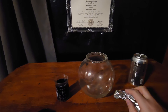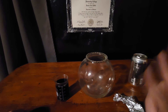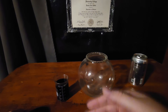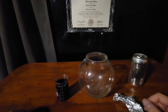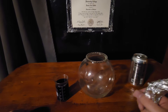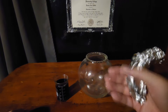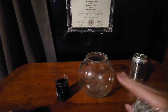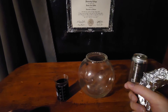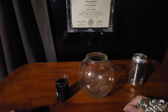There were several things I wanted to mention about the cola. You may say to yourself, I'm using a diet cola — is there something special about that? Two things. One, diet cola actually usually has less phosphoric acid in it than a standard cola. And you might ask, wouldn't more phosphoric acid work better? The answer is actually yes. The reason I'm using diet cola, other than the fact that it was on hand, is because it doesn't have real sugar in it, so it doesn't get things as sticky, doesn't attract bugs, and it's easier to clean up. A diet Pepsi has approximately 30 milligrams of phosphorus per serving, whereas it's closer to 50 in a regular cola. So regular cola will work a little better for the actual conversion of rust into iron phosphate.